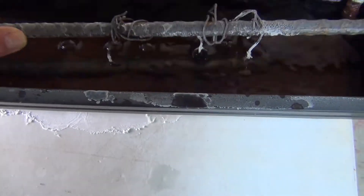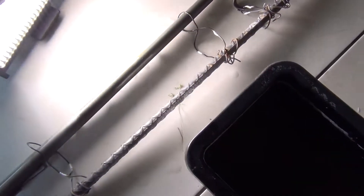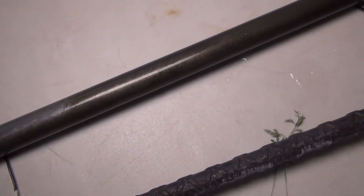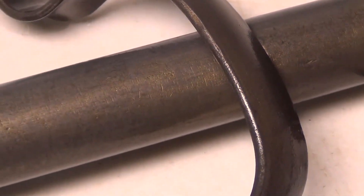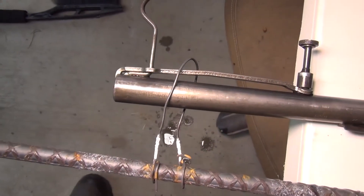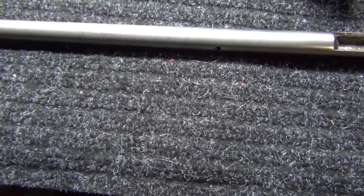It's already been disconnected — there was no more fizzing going on. I'm gonna shake this a little bit and pull this thing out. I'll give you a much better look here in just a moment. I think that's a total of five days on the electrolyte solution. I'm thoroughly impressed. Now I'm gonna take a wire brush to it, get the first sanding coat on it, and get some WD-40 on it so I can keep it oiled until I'm ready to do some real work to it.